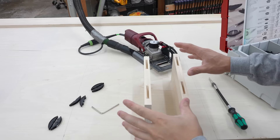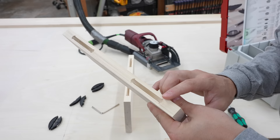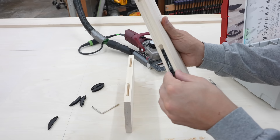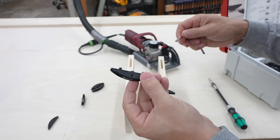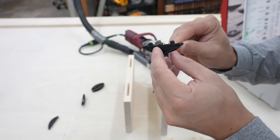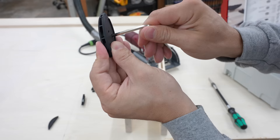For those of you who aren't familiar with the Lamello, I'll give you a little demonstration. It kind of looks like a standard biscuit joiner slot, but it's much larger with an oblong cut at the end. These pieces slide in and can be removed. For the Clamex style, there are two different pieces — one is a standard piece that gets latched into, and the other is a cam action piece with a hex slot. As you turn that, the metal piece creates a cam action that pulls the other side together. Insert the hex wrench, tighten it down, and the two pieces become one.